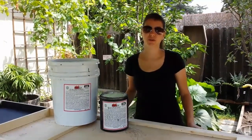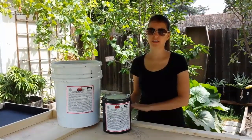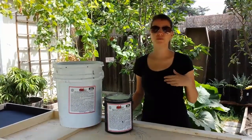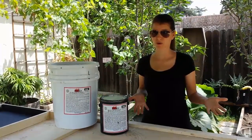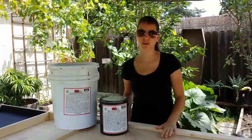One of the things you may want to do after your wall panel or flat has been built is paint the back side. Unless you don't mind looking at bare wood, there are a few reasons why you would want to paint the back. One is if people are going to be seeing it or you just don't like the look of bare wood. Another reason might be because you have a fire marshal coming in and you can't have any bare wood exposed.